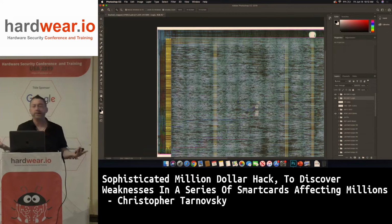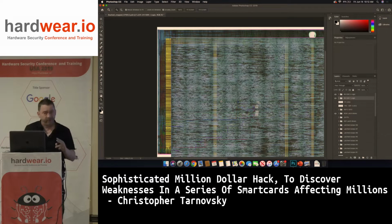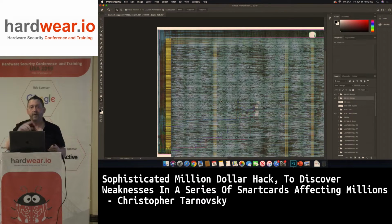So where can I put a needle down? I can put a needle down to listen, just to listen, in between XOR 1 and XOR 2. XOR 1 decrypted the ROM fetch. XOR 2 re-scrambled every reset the data bus. So we put a needle down in between XOR 1 and XOR 2, and we can listen to what the chips are running. But we can't do anything.